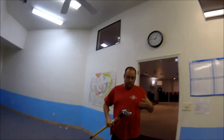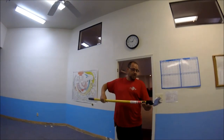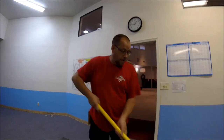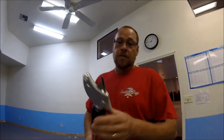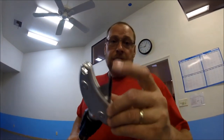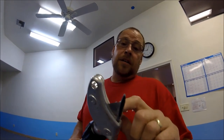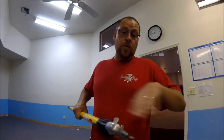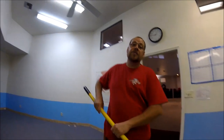So we're fixing to start cutting up the carpet. This is what I got right here — it'll twist out and extend to make it longer, but I like to use it short. That way I can put all my weight behind it, makes it go a little easier and I don't strain so hard on my arms. It's a little spiky here, and this is just an average utility blade — you can swap it out, loosen this and put new blades in. This point will get right down on the floor and slide, and it pushes the carpet up to this blade to slice it right up.